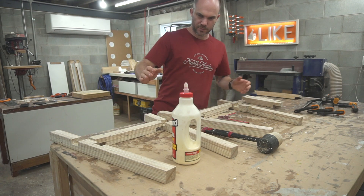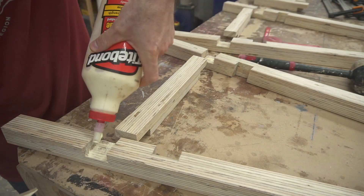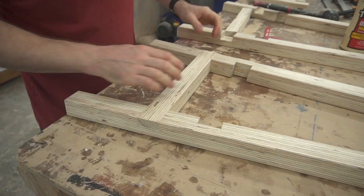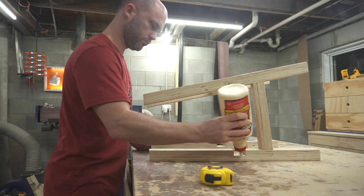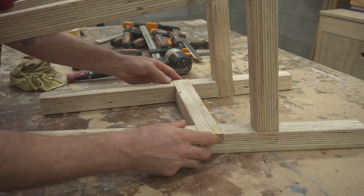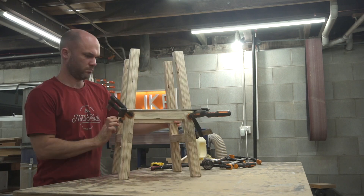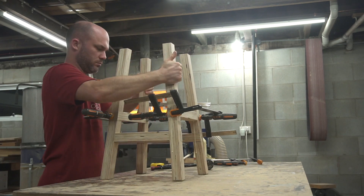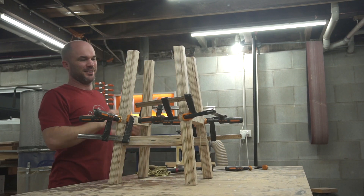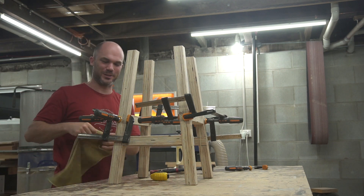Alright, glue up time. I've got my glue, mallet, and angle finder set to the correct angle. I'm going to start by gluing up the legs into two halves, and once these are dry I'll bring all four together with the other rails. One of the cool things about half lap joins is that they are self-aligning — particularly if you've cut them properly — so glue ups like this are pretty stress-free. That join tightens everything up and lines it up. And it came out unbelievably square — I was not expecting that.